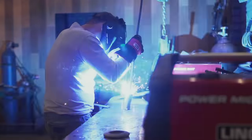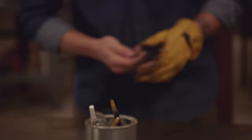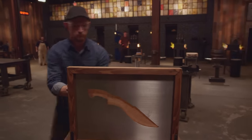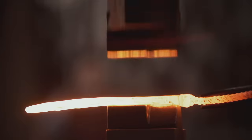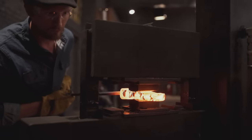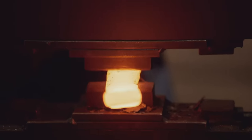Dale and Keaton already have work sticks welded onto their rounds and they've got them in the forge. I look over and I see Keaton and Dale over there welding already. I grab some paper and trace out my shape so I could measure and take dimensions on different aspects of the blade. Logan immediately comes over with a piece of paper and he's going to trace out his design. My plan is to take it over to the press, draw it out to about three inches shy of the length, and then widen it to about two inches of the blade. The first step to me is to pull that metal out.